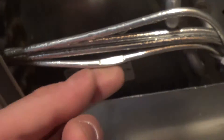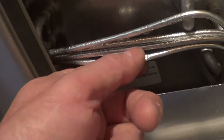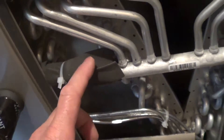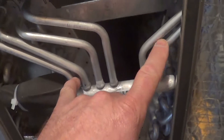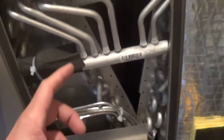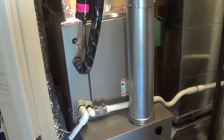I have to do a disclaimer — don't do this. I'm just nitpicking this system. Increasing the capacity maybe 5%, that's probably all that did. What happened was this circuit was overfeeding, and it was causing the other circuits to pinch back because of the expansion valve bulb. So I was running a little bit low on the other coils and a little high on the overfeeding circuit. I just wanted to address that little bit of low suction pressure.